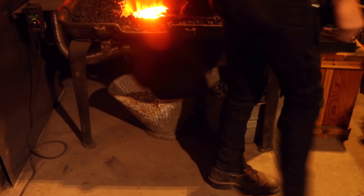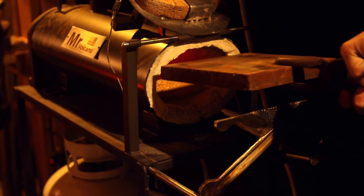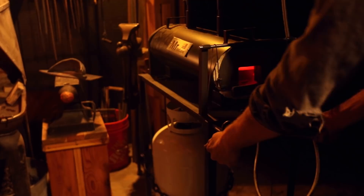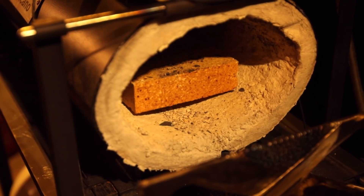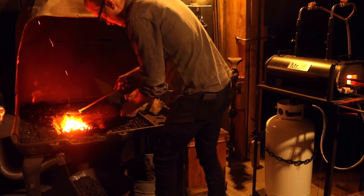Let's say I want to move one of my heat sources. The coal forge is massive and probably more than what most users will ever need — though I can heat up huge pieces of steel in it, and I'm pretty limited on what size stock I can put in the propane forge. The propane forge is easy to lift and move wherever I want — I put wheels on the stand just to move it around the shop. As far as keeping the systems tuned, the propane forge may run into issues with the refractory crumbling over time. The coal forge is kind of indestructible — as long as I keep the pot cleaned out and the blower works, it should pretty much run forever, or at least longer than I'll be around.